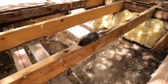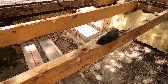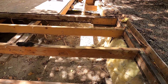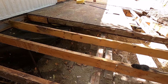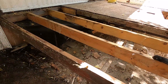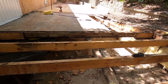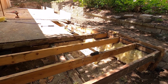A little further into this now and I've come across a furry little friend — found him underneath right here. He's dead, very dry, been there a long time — petrified. So this is what I'm finding underneath here. We've got two-by-six joists and they're over-spanned. What they've done is put this mickey-mouse little double two-by-four underneath as a kind of beam — you can see how they've done that to try and take the bounce out. The minimum you should go with for joists is two-by-eights.